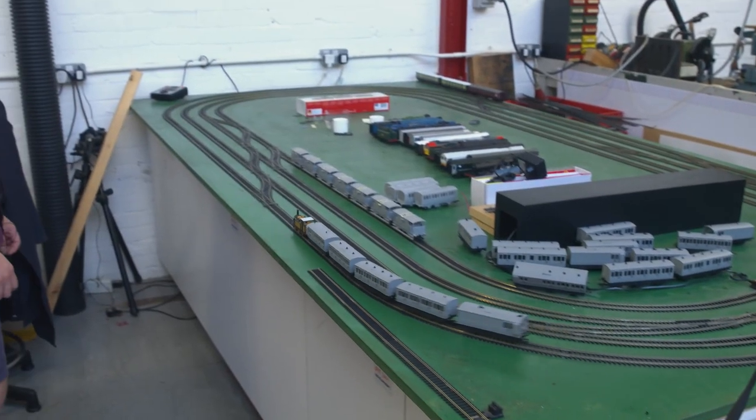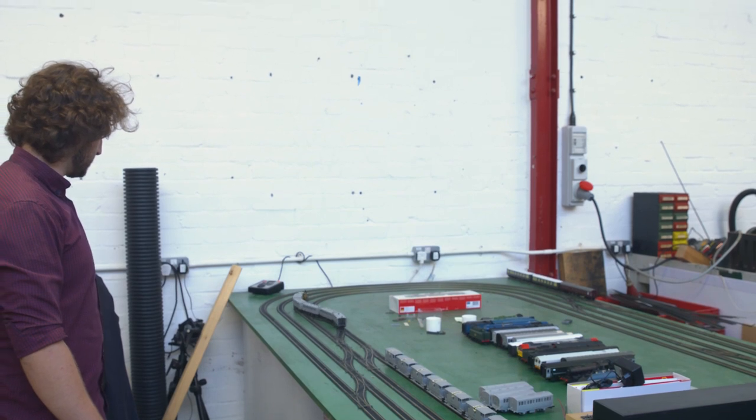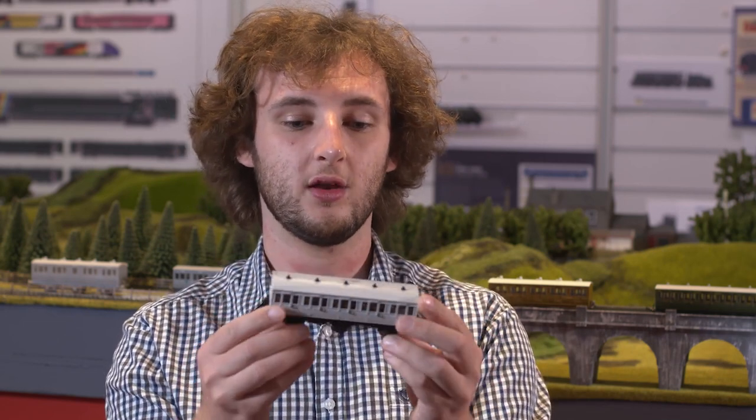During the design process there are a couple of challenges that we faced. The first one was with the wheel set on the four-wheel coach — they've got pinpoint axles and they run nice and smoothly, a lot like many of the brake vans or other small wagons that we've made. With the six-wheel coach these are a little bit different because of the long wheelbase and the center wheel; there needs to be quite a lot of side float to get around our tight corners. A lot of work went into making sure that the brakes are the right distance away from the wheel flanges so these wheels can move as much as they can to allow coaches to snake around our curves.